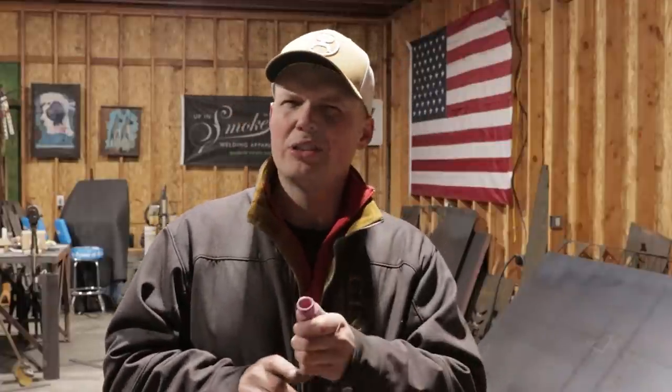I felt like I used way more purple tungsten than I did 2% thoriated, which is the red tungsten, for stainless or carbon. And so anyways, I always use an eighth inch tungsten. I prefer eighth inch tungsten. It seems to just do everything I need it to do. So just something to think about when you're buying tungsten.